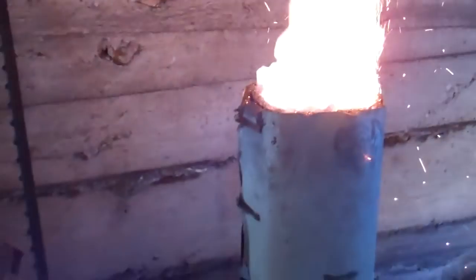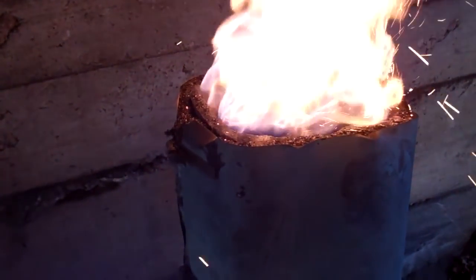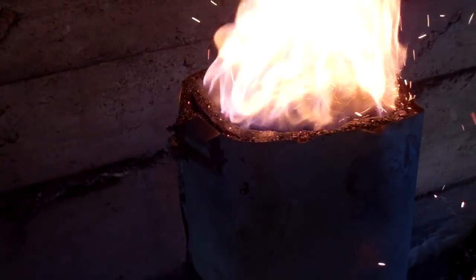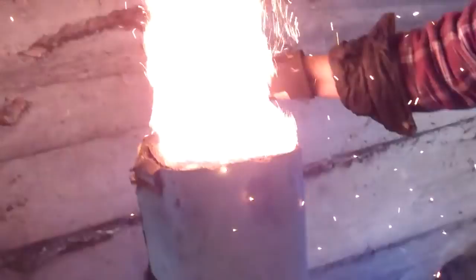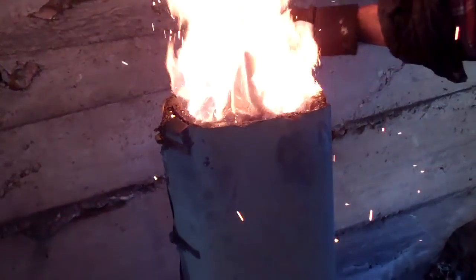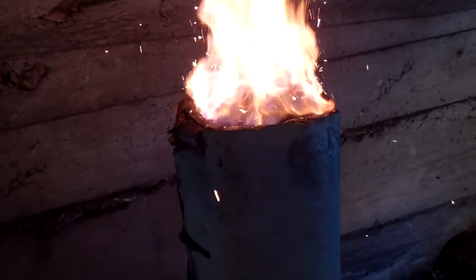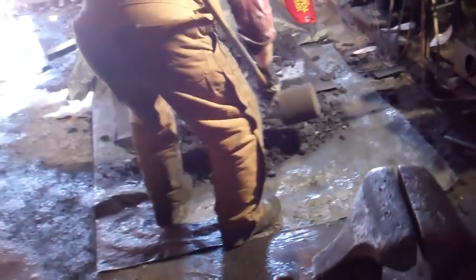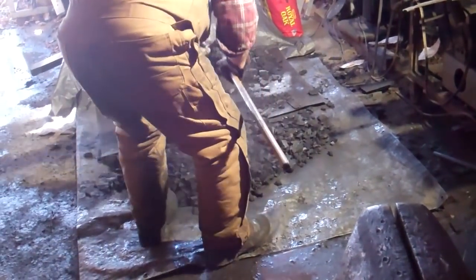Oh, yep. See, so now the reason he's going to feed it is that the charcoal level has sunk down about 4 inches from the top of his chimney there. First, the black stuff goes in. Now about looks like about 3/4 of a cup. It's actually a half cup of the iron ore. And then next he's scooping up a coffee can on a broom handle there of charcoal, put in the top there. Number 10 coffee can.